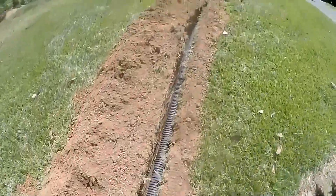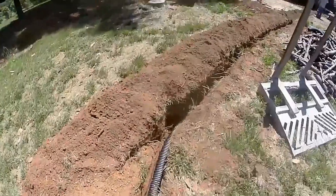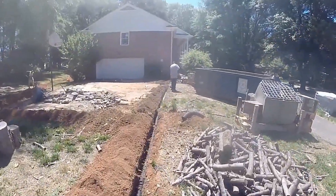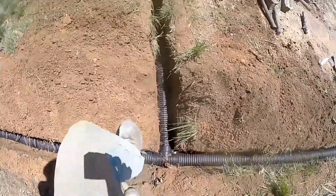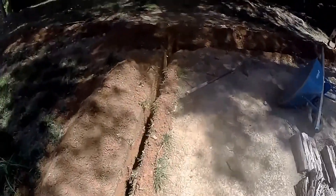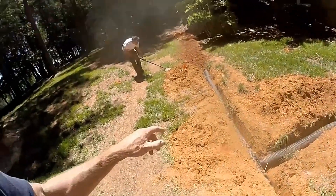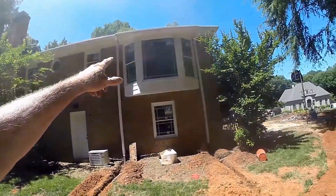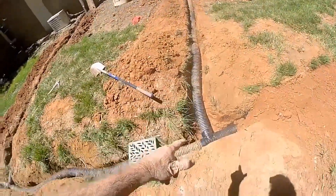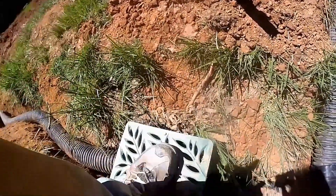Here's our trench with our installed yard drain — actually this is called a yard drain, not a french drain. French drains have gravel and perforated pipe; this is all solid pipe coming from the downspouts. You can see our PVC pipe up here under the drive — connection here is coming from the back, comes around, runs all the way back, and the guys are starting to cover. Paul's covering up the back, making quick work of it. We've got our downspout tee picking up the roof, comes down, picks up more downspouts, and there's a catch basin in the low spot. It may look high here but we're about four inches below grade, so when we backfill it'll really drop into the system.